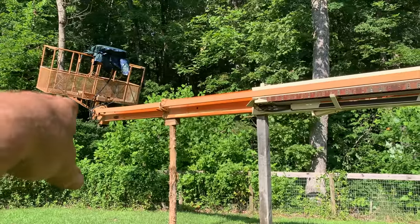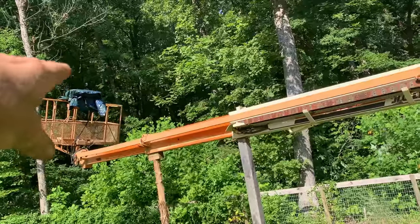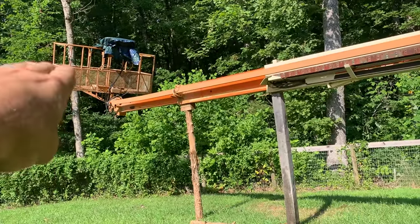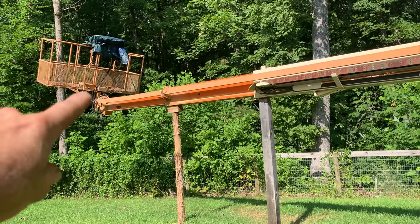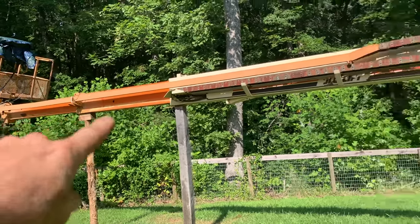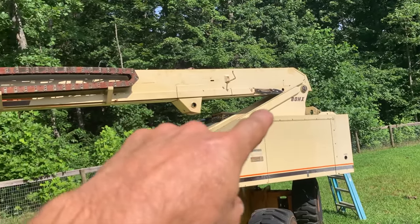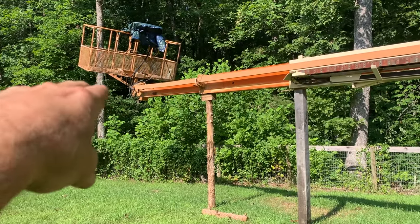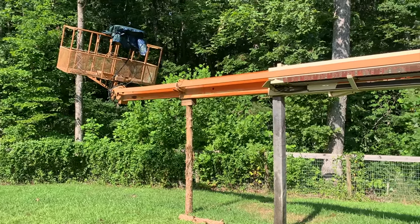That platform is at a certain tilt, and as the boom goes up, if it didn't do anything, it would tilt. Like you can see, it's tilted way out of level now. In order for it to stay level, hydraulic fluid needs to move in proportion to the boom position. Well, that's exactly what that cylinder does. It's basically acting like a pump that is then driving the leveling piston to keep it level as it goes. Pretty cool. Interesting mechanical way to make that happen.